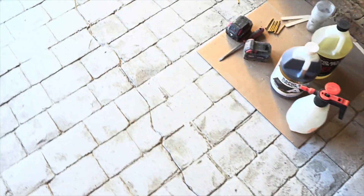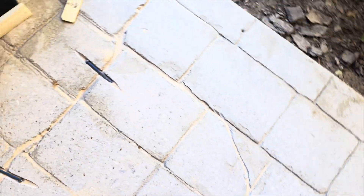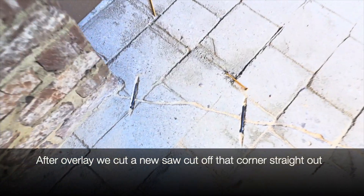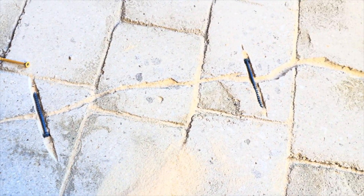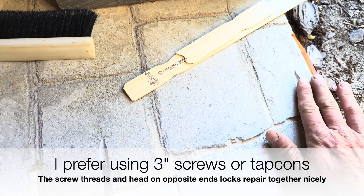What I'm doing here is putting sand in there. Basically I put the sand in and filled it up, then take a little brush and brush it so it's an eighth to a quarter inch down all the way through. Here since this is a structural crack and this is just a shrinkage crack, we're just going to fill that one - there's no movement there. There is movement in the structural one so we're going to stitch that back together. You can see we put the sand in, brushed it, dropped the screws back down in - basically this is ready for our crack repair.